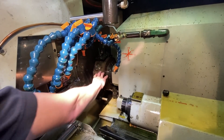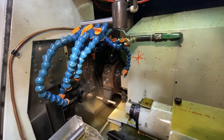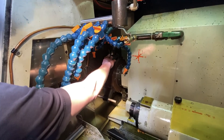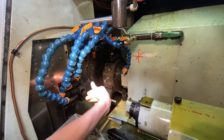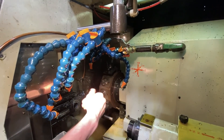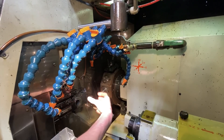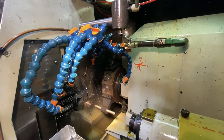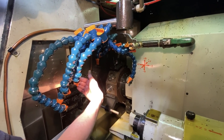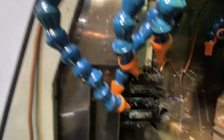This machine is equipped with a turret. Each of these turret holes, just like on a regular big Haas, has live tools — this tool right here is an end mill. For making complex parts you're able to go on the Y and B axis. This machine has C axis for the sub spindle and for the main, so you're able to get some really cool geometrically made parts. Here are the live tools for the gang, and here are stick tools for the gang — a really, really capable machine.